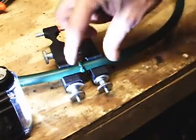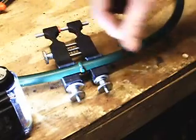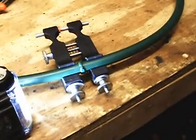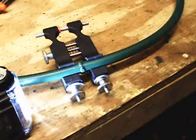Like I said, remember, don't screw it together so tight that you push all your center hot weld material out of the dead center. You don't want the cold cores to touch. Since I am done now, I'm going to go ahead and unplug the iron. I'm going to start letting it cool in a safe place till it's totally lost all temperature and I can put it back in our storage.